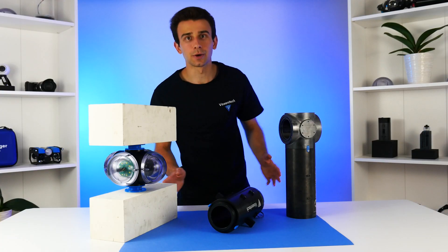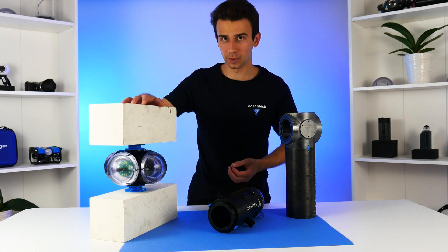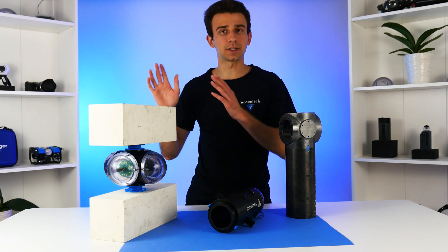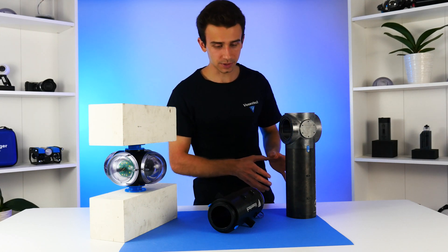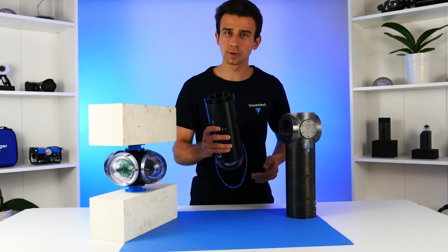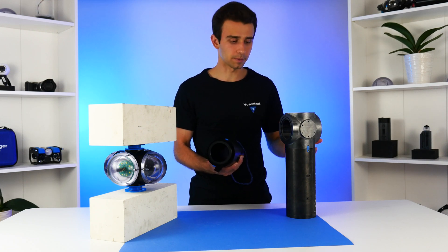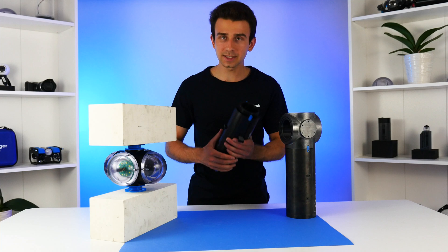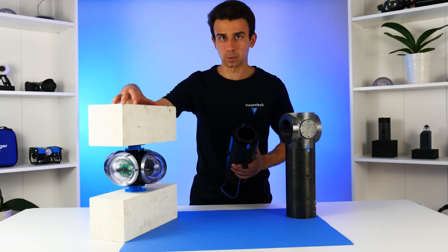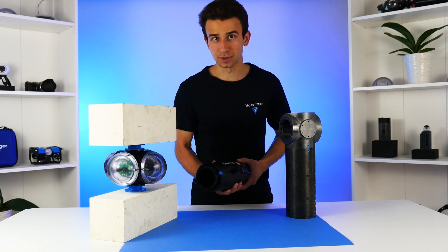Halfway through filming this video, I realized I made a pretty big mistake in the calculations for how much foam we would need. So instead of ordering more foam and making it even more bulky, I decided to get the housing components remanufactured out of a lighter metal. This is made out of aluminum 7075 — it's comparable in strength to steel, not quite as strong, but quite significantly lighter. This means these foam blocks will have enough buoyancy to support this lighter housing, which is good because we want to go and test as soon as possible.